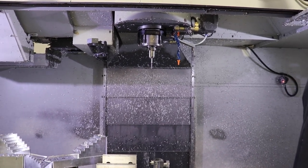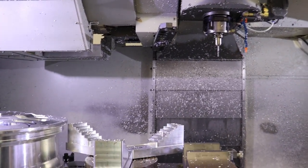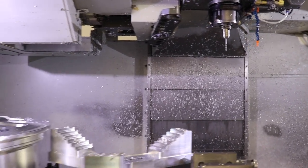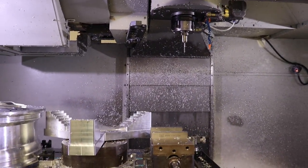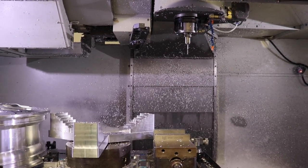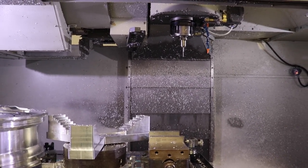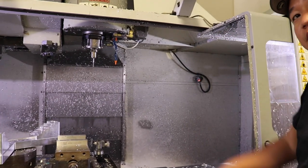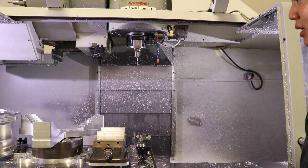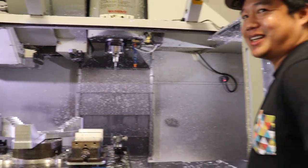This is unbelievable, dude. And people think three-piece wheels — they don't get why they're so expensive. There's a lot that goes into it. They don't realize there's so much just from the materials all the way up to this point. And that's not even including your finishes, your plating. After the mill, it goes to prep, polish — some guy has to blend all the machine marks — and then painting and assembly. It's a lot of stuff, man.